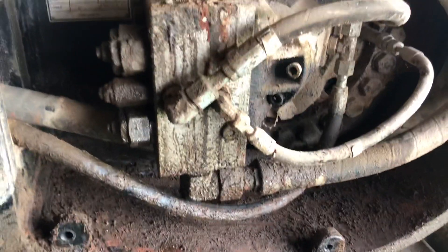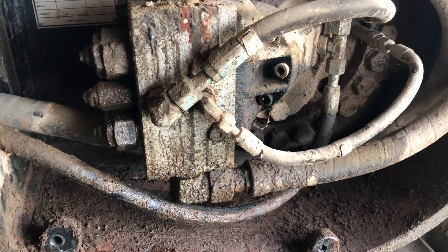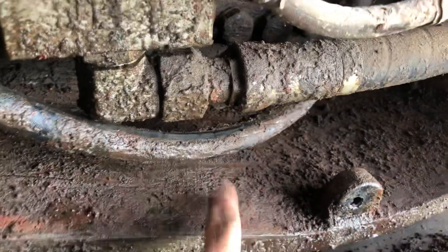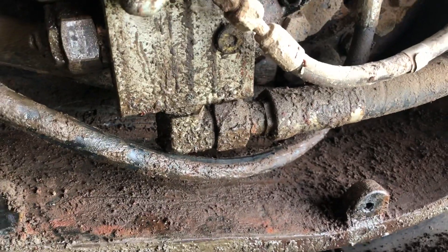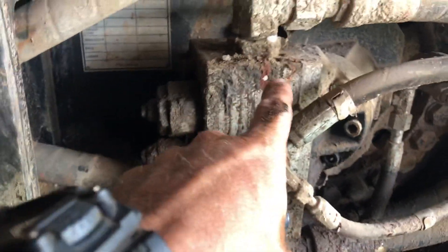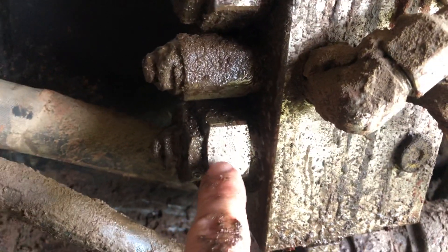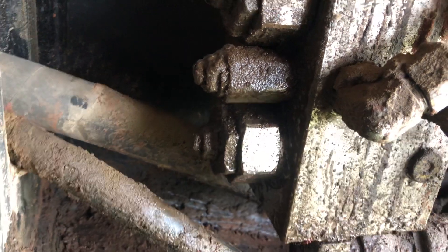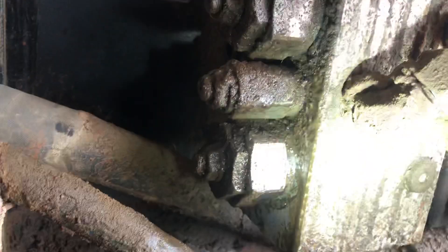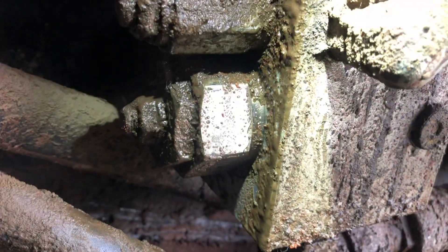You start at the lowest point and work your way up. So obviously the lowest point here would be down in here, and I cleaned all that out. We have a clear path of oil — it goes up the block. It's not leaking up here; it looks oily but it's dry. What makes me think the leak is over here is the fact that it's pretty clean in that area. Somewhere in this vicinity is where our leak is — right there, it's really clean.